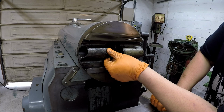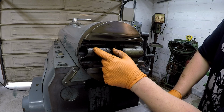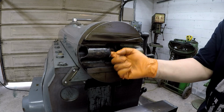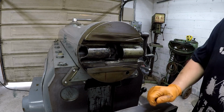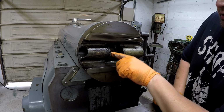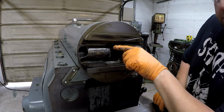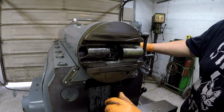You've seen that. There's a gear. This is a bevel gear, and it's floating inside this bore right here. And there's a keyway inside. There's an internal keyway and a bore. So that's telling me something is missing that should be in this gear that's not in there, because this is why the auto down feed was not working even whenever I was doing it manually.